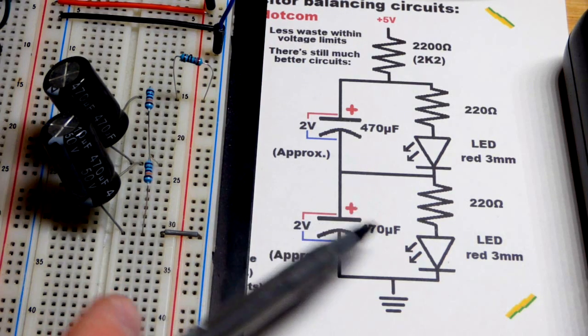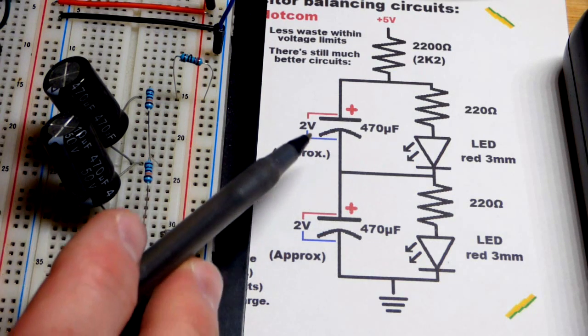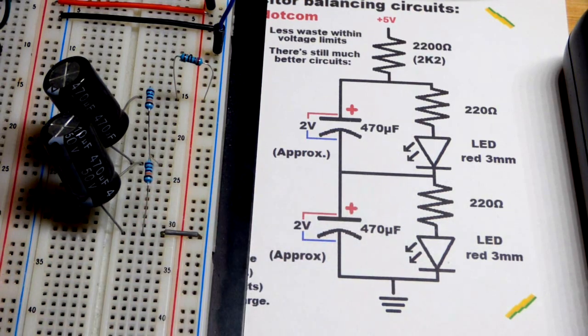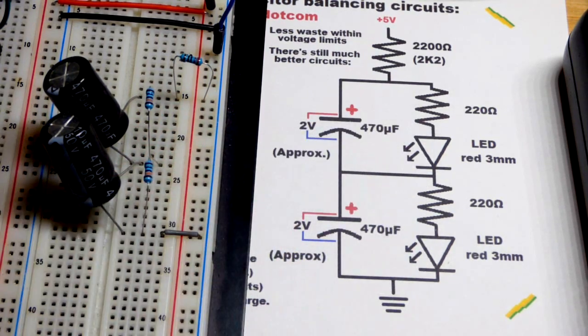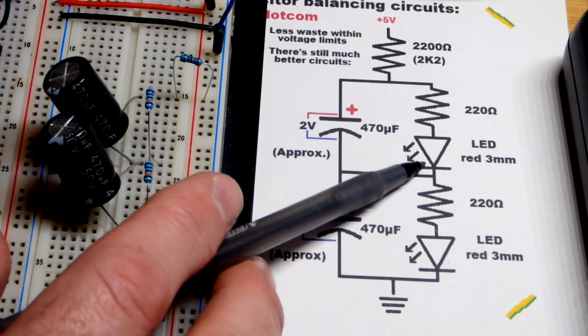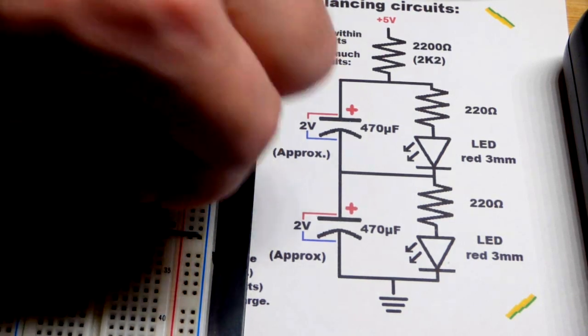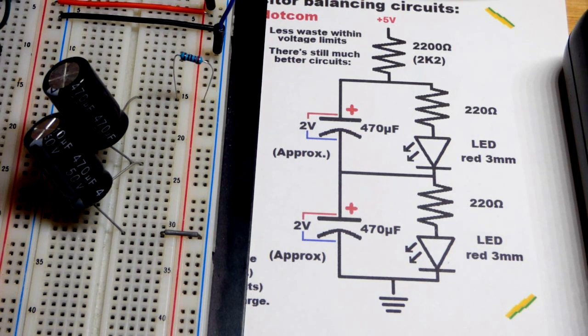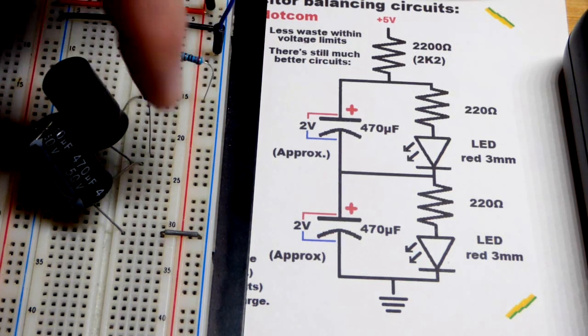So now we're going to improve this circuit. This is more for making sure we don't overcharge — like supercapacitors that can only handle about 2.7 volts. This is a simple setup but there are improvements. The main takeaway is the capacitors are going to charge easily until they get to the voltage we set, in this case with an LED. The LED will also let us know when we've exceeded a voltage. The voltage that an LED blocks depends on how much current is going through it — the more current, the more voltage it blocks. We could use a zener diode or something that starts letting current flow once you reach a certain voltage.